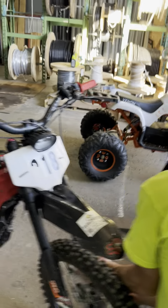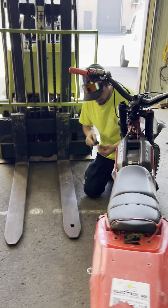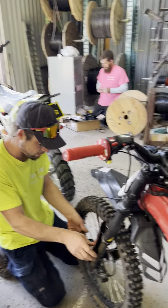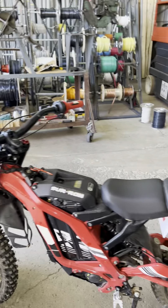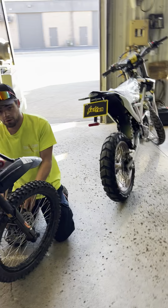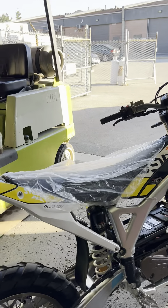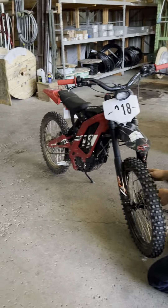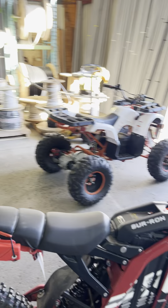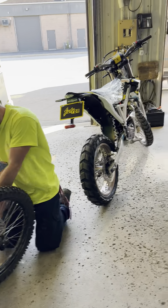That's why sometimes we're gonna have to install these big boy transformers to get people charging quick. We're doing a Ford Lightning charger this month — the guy just got it. Should be really cool, a different experience from the Tesla one. It's a 100-amp home charger. They've got 200-amp service at the house, but the wife's also getting an electric car, so now we're looking into current monitoring systems.